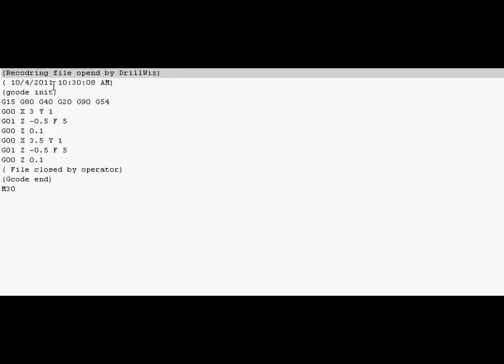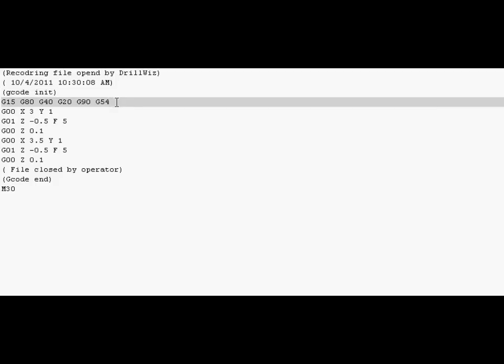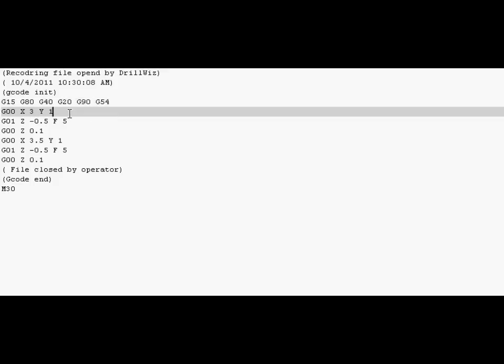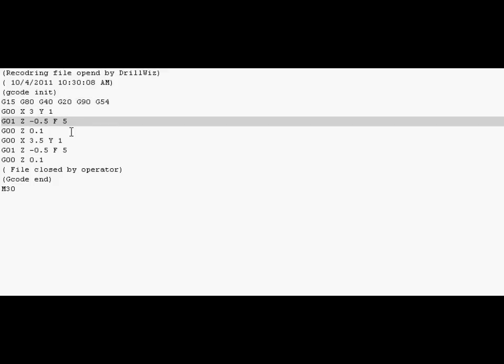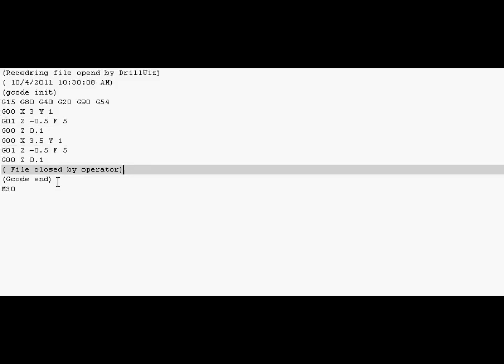The first line has a heading, followed by the date. The next line is an interesting addition: in the root directory of the wizard there is a file called "gcode_start.tap" and also a "gcode_end" file. This file contains initialization stuff for your G-code. There is a default file, but if you want to change it you can add to it — for example, if you always wanted to start with some particular conditions. Then we have the lines generated by the moves: an absolute move, a plunge drill, a retract, an incremental move, and then the G-code end file.